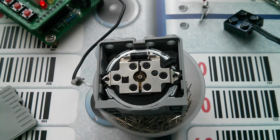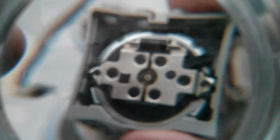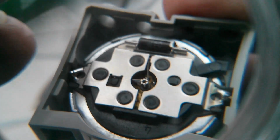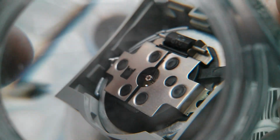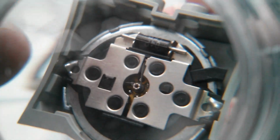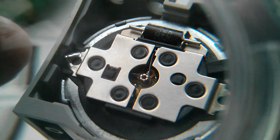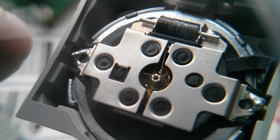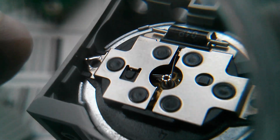So this is what's in the back of the motor. It looks like that's the commutator, that sort of split shaft thing. Let's bring that a bit nearer, with some very fine sort of fingers that seem to be laying onto it from the left hand side there, and also from the top. It's a strange arrangement, but that's seized solid. That component there, I would imagine, is a capacitor. So all I can assume is that the lubricant that's inside here has gone hard and this thing's just seized completely. I could try and coax it with more current and voltage, but there's a limit to how far you can go with that, isn't there?